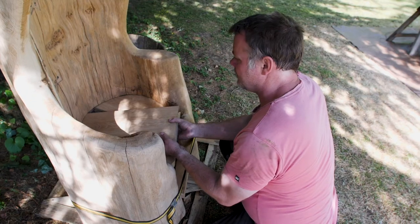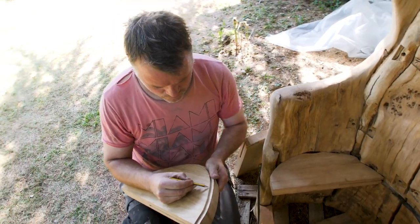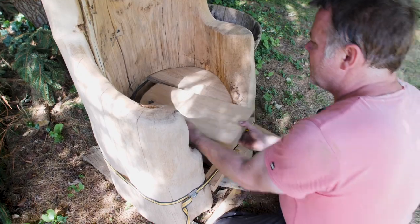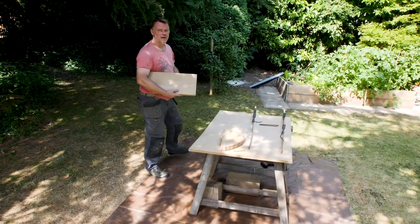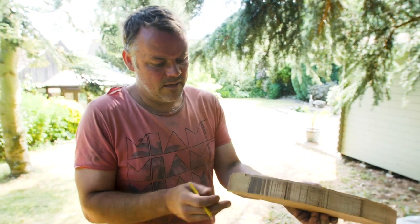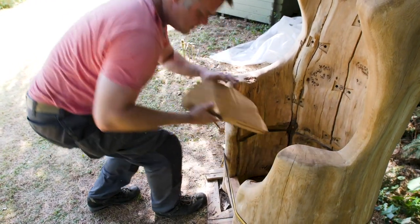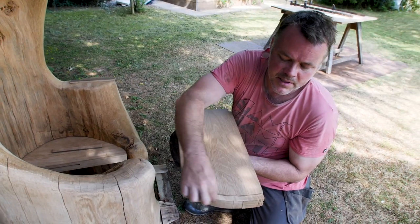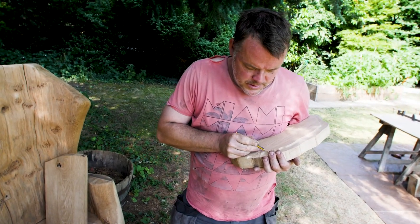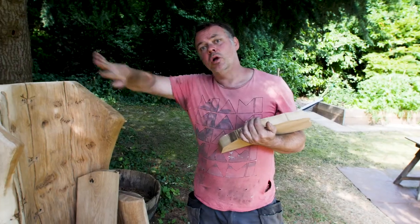Let's have a little look — on a scale of one to ten. We'll get it to fit, it's just going to need some tweaking. We just need to lose the front edge there. That's all starting to look like it's working now. I'm just going to knock a tongue off that corner — freehand routing, here we come. We initially took ten mil here; I've freehand routed and we've taken about fifteen now. We're going to glue and clamp it, and before we get to that point we're going to shape a scallop out for the button.